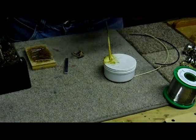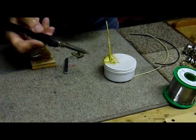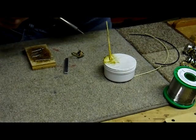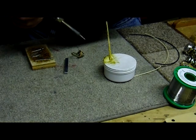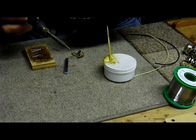To start the ball rolling, you need to have a good soldering iron — not a gun, but an iron. You want an iron that's approximately 40 to 45 watts. Don't go for a lower wattage iron. It's going to be a real problem when you're trying to solder components to the back of pots — very large metal surfaces that don't heat up very well.